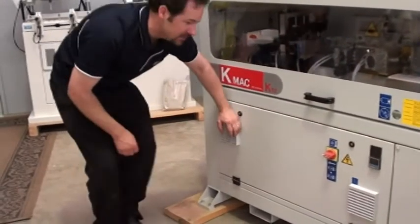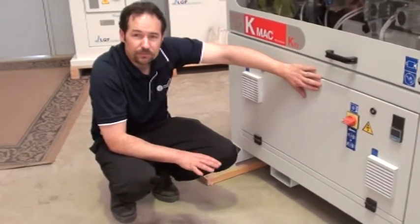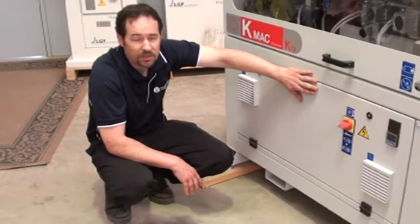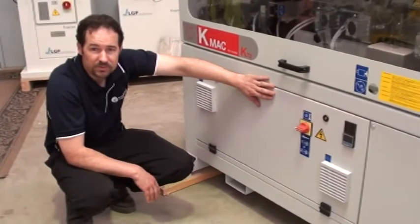The main thing I'd like to stress on electrical cabinets is, it doesn't matter what type of electrical cabinet — basically never use a blower inside the cabinet itself. Always use a vacuum cleaner. And always make sure the power is switched off. You want to make sure safety first.